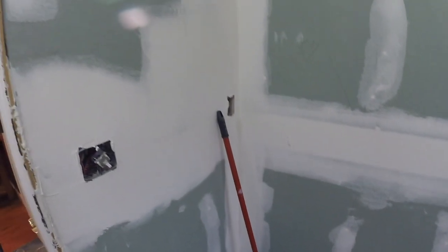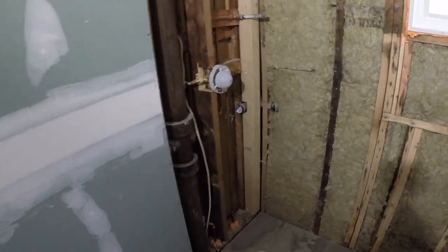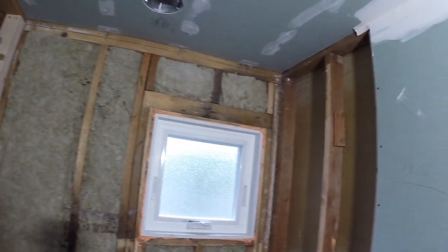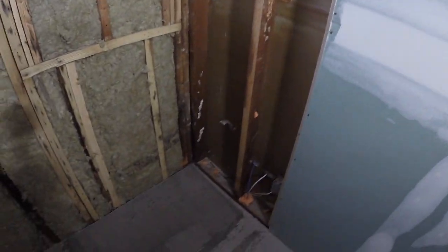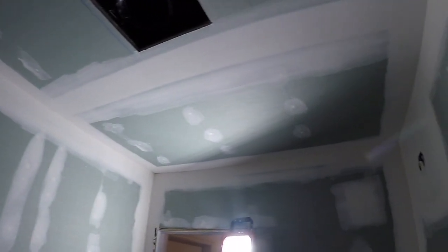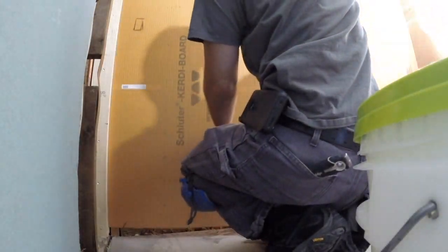This video will consist of a full shower build using Schluter products. We're going to be using Kerdi-Board on the walls and the Schluter tray. We're making the curb out of two pieces of 2-inch Kerdi-Board, wrapping everything in Kerdi to make sure we're 100% watertight, and then we're going to flood test it after the thin-set mortar has cured for 24 hours. This is the process we like to use to install our Schluter products.